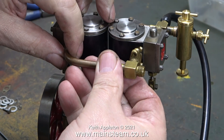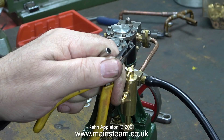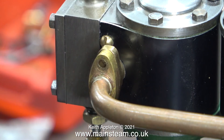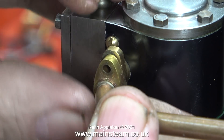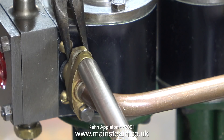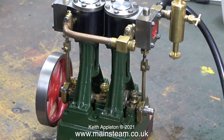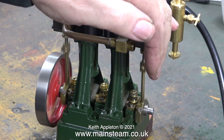In the clips that you've just seen, it's very clear that the engine's timing is not set quite right yet. I think it's time to fit the exhaust piping. I'm using more or less the same principle, but instead of the pair of forceps I'm using a very small pair of pliers, and to help the alignment I'm using the point of my scriber. All I need to do now is fit a gasket in between the flanges, and then fit the bolts in exactly the same way as shown previously. It's a bit of a puzzle why the flanges are not exactly the same shape as the gaskets, and also why the threaded flanges are not the same shape as the flanges on the piping — the piping and flange sets are commercially produced items. Eventually they fit together and everything looks okay. Here I'm checking the amount of blow from the exhaust and it's quite good.